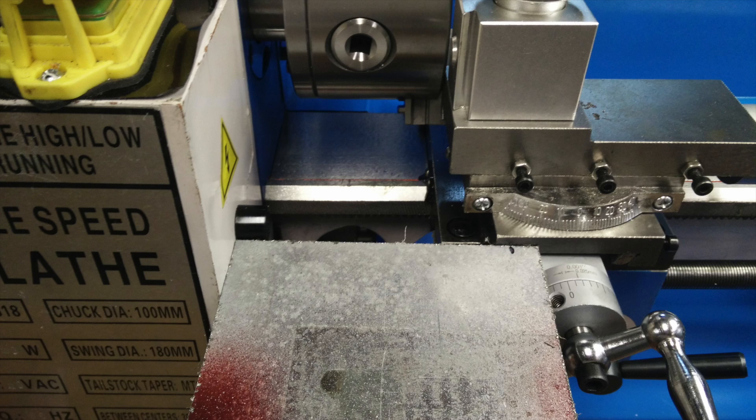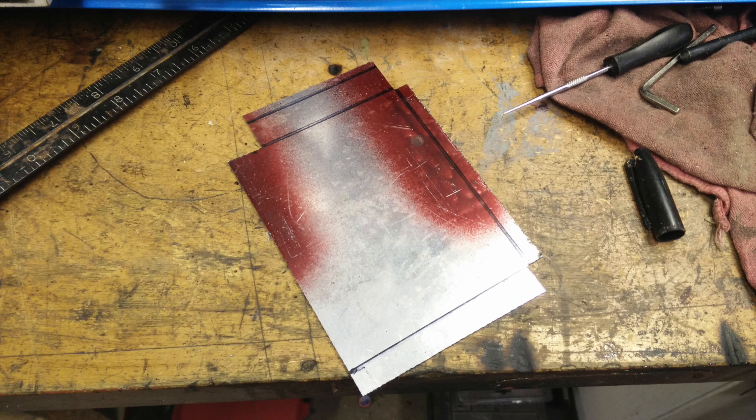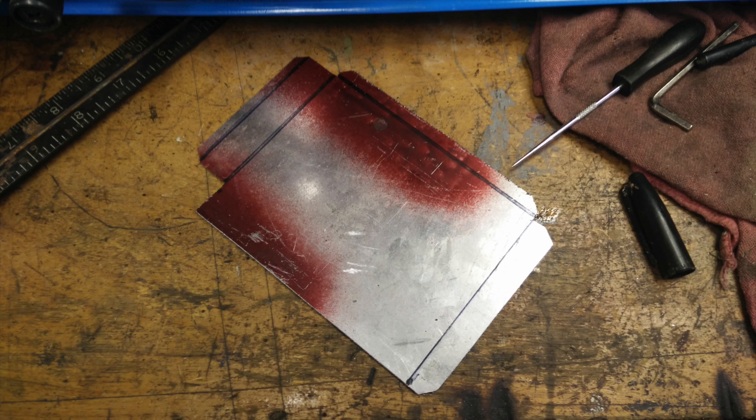This is marking the width to try to get it as large as possible but never in the way. I marked the places I wanted to bend and also the pieces that had to be removed to allow the metal to bend on the sides. I also rough cut and ground-smoothed the corners so there was nothing left to get caught on or scratched by.